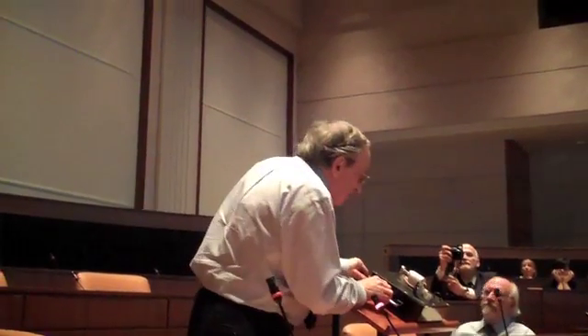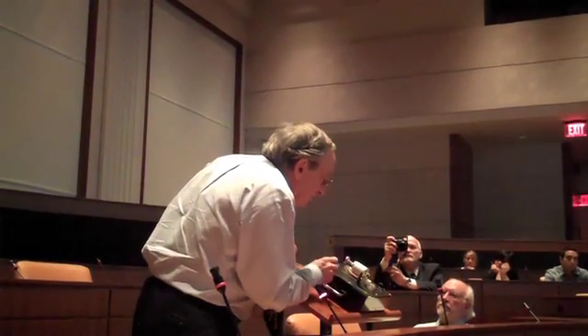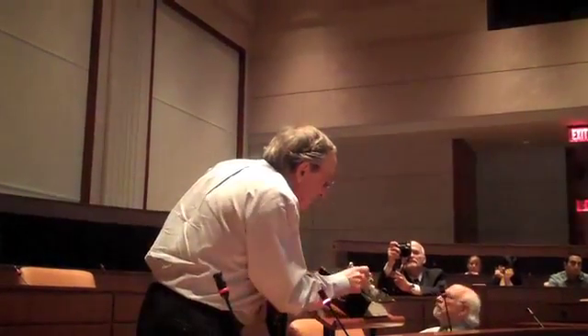Should I fire it one more time? Okay, for those who still missed it. What volts did you need? I'm using 1200 volts instead of 950 because I want you to see a nice spot. The laser actually started at 950, but if you look at Ted's notes, he really got very good laser action around 1300. So at 1200 volts you get a very clear spot.